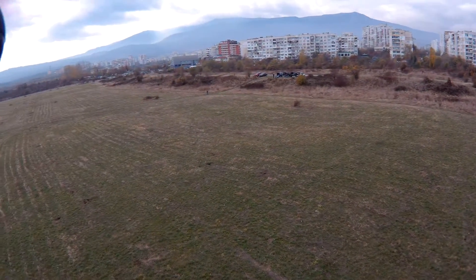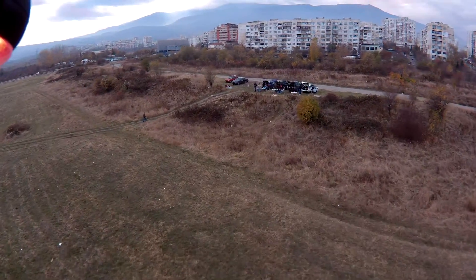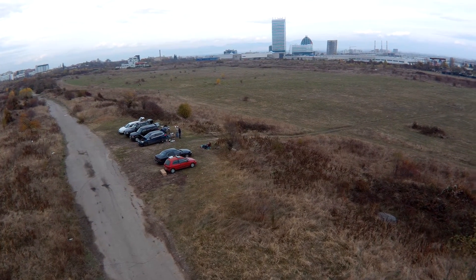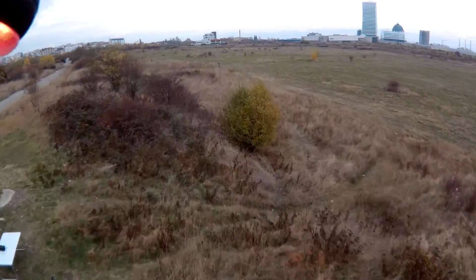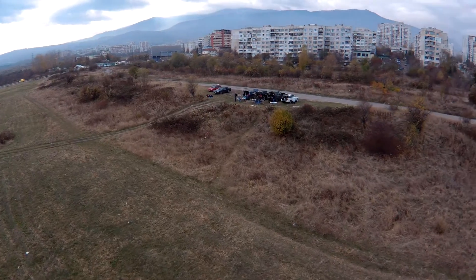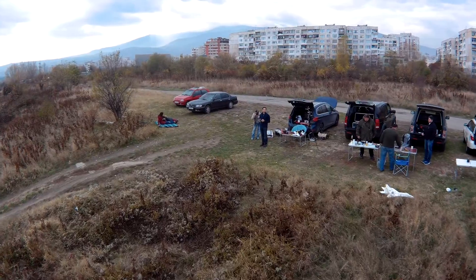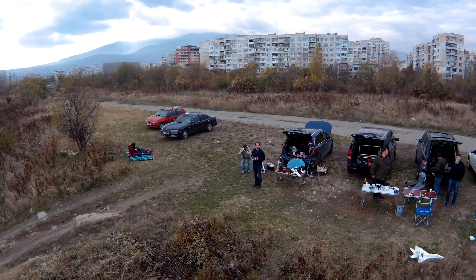Now if you see the footage here from the E350 Pioneer, you can see that there are no vibrations per se, but there's this kind of shaking when the copter is flying around, which is not bad for most cases — that would be perfectly fine unless you're really trying to get some perfectly stable footage, which is not an easy task on platforms like this that aren't DJI. I've balanced the props separately and I actually wanted to balance the motors and the props together for even better results, because once I put the props on the motors, things didn't feel quite as good as they could have.